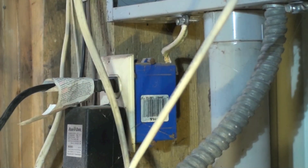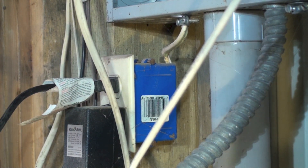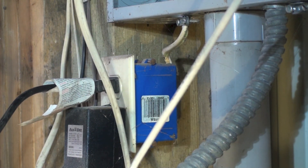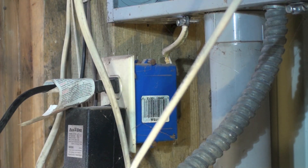It told me I can't use an earth ground as one line. Now, there are people who do this and there are power systems that do it, but if I put 120 volts into the ground on one side and try to take that power out 200 feet away, it's not going to work.